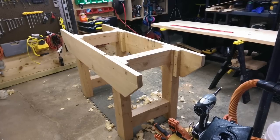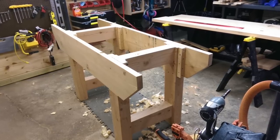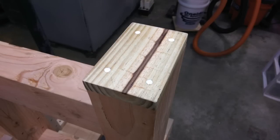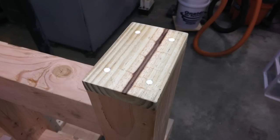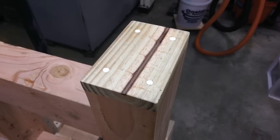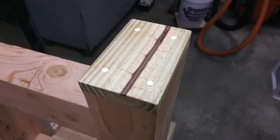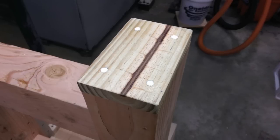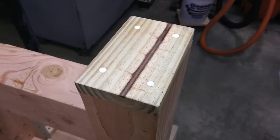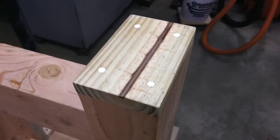Welcome back. From the last video we left off with the bench upright, basically lacking its top. I did want to backtrack to something you may or may not have noticed. Because I get a little bit of water in my basement - not flooding, just a little wetness on the floor - I wanted to protect the legs of the bench. I had some extra pressure treated lumber, sliced it three-quarter inches thick, and placed it on the bottom of the legs so that the face grain would be downward towards the floor. I secured it with screws and used exterior grade caulking to seal the screw holes, to keep any moisture from wicking up into the end grain of the bench legs.